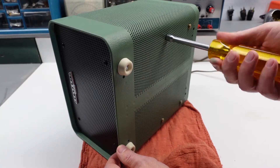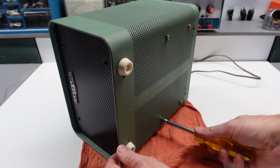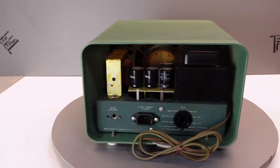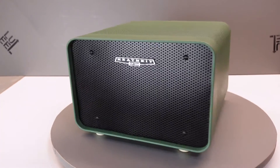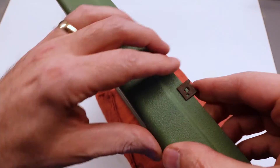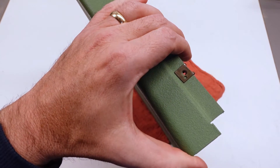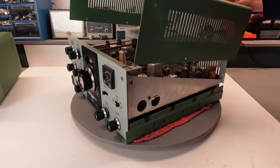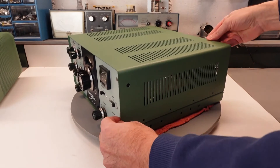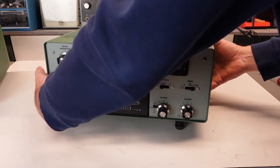The speaker goes in and fastens to the wooden speaker support using four bolts — the ones I painted earlier. After that comes the beefy power supply, secured with four bolts. Then I attach the two back feet and it is done. Before I can put the case halves back on the HW101, the Tinnerman clips need to be reinstalled on the bottom case. The chassis gets sandwiched between the top and bottom case with over a dozen machine screws and sheet metal screws to lock it all together. The four original black feet go on last.